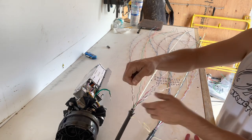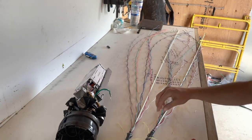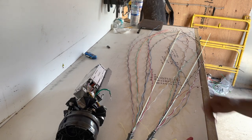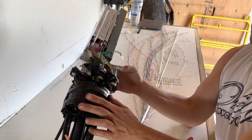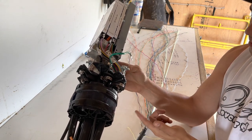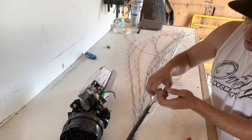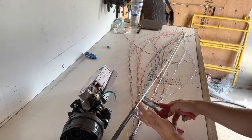Inside here, got one little string, moisture string. Go ahead and take those right out. Now, since this is a BS closure, we're really not going to have much room from the ring cut for our strength member. So we don't need to leave a whole lot on there because we're going to be cutting it down pretty short. So, for instance, on this one, I'll get it right about here for now.